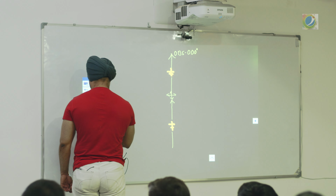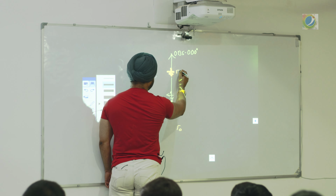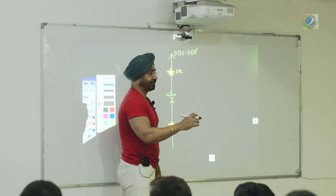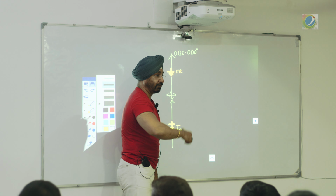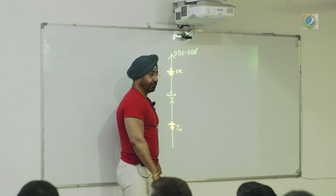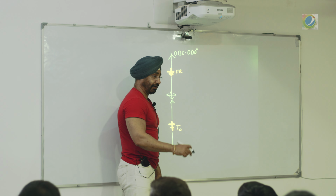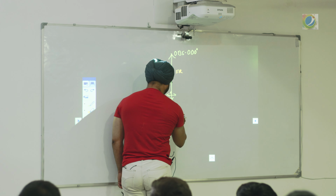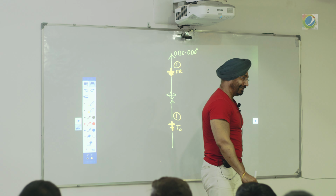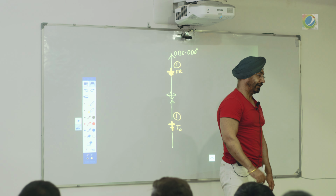That's how this indicator works, what practically happens. So, if you are here, it will show you TO, here it will show you FROM. That's what the indication has generated. Your OBS is 360 and you are receiving a phase difference of 000, which means you are north of the station, and that 000 track will take you away from the station. Your OBS selection is 000, but you are receiving a phase difference of 180, so the track will take you to the station. The CDI will be centered here. Yes? The CDI will be centered because what you have selected, you are on that track.